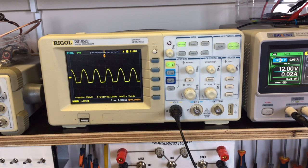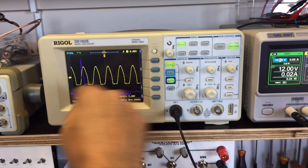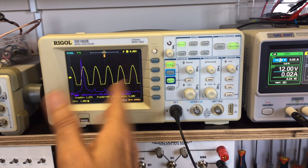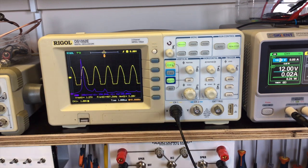That is definitely not a very nice wave. Yes, it will act as a BFO — no problem — because the fundamental is there. There's the fundamental right at 460 — I can adjust that. It's got all these harmonics, but ultimately you want that fundamental to be strong and steady. Let's see just how steady it is in a minute.